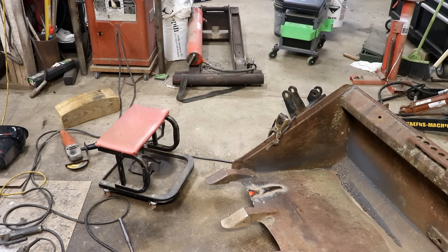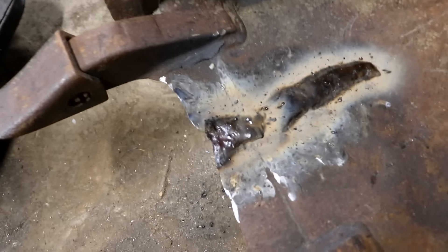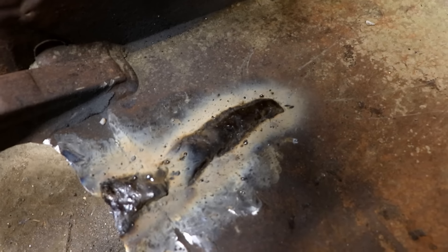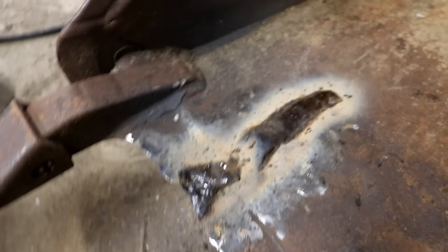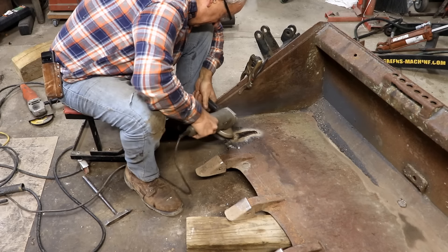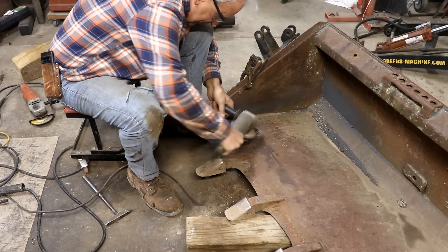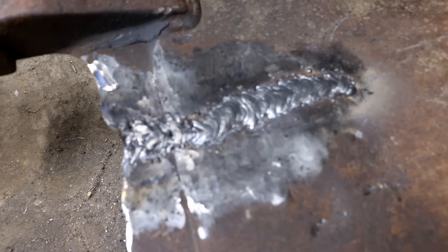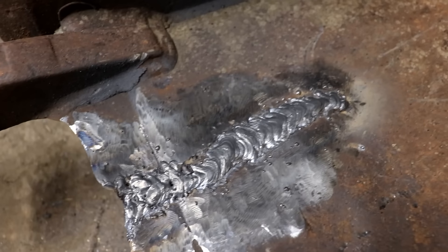I'll give you a close-up look at that before I clean it up. You can see it's a fairly wide weld because the crack had widened out quite a bit. But I don't have that bunch of dobs of junk on there — they had it dobbed out on both sides, all the way around. There's no reason to put weld out there; that's not holding anything. Now I'll clean that up. It ain't a great weld — I'm not a welder — but it's not just a big bunch of chicken poop popped on like popcorn. This weld penetrated and went way down in there. Now I'll turn it over, clean up the other side, and do the same thing.